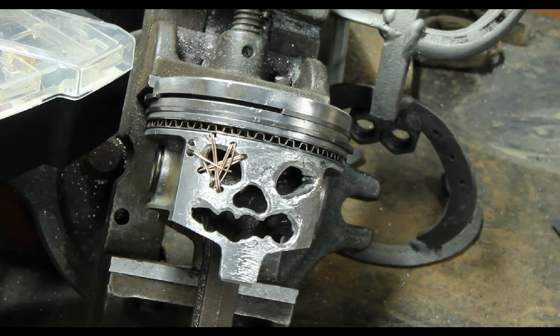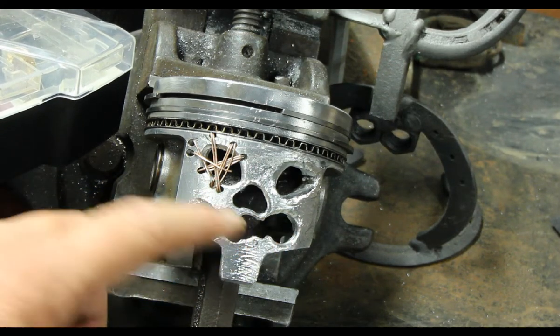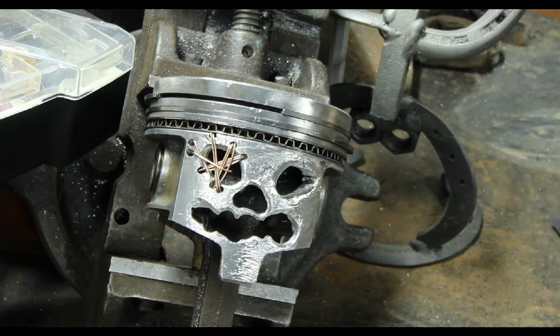And then I used a jigsaw with a metal blade, and I came in here and I cut out most of the rough, large area of the mouth, whatever I couldn't drill out. And I would tell you, drill it out as much as you can. The jigsaw method worked, but it wasn't the best way to do it. Probably some kind of a real good die grinder would have been better.